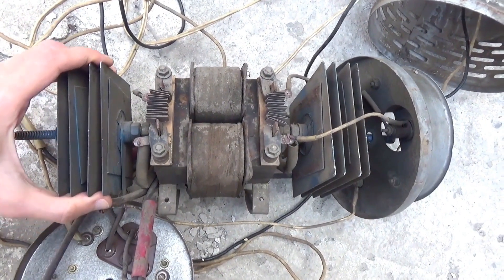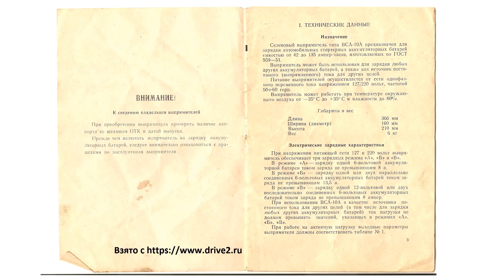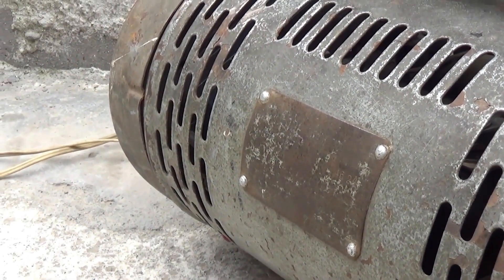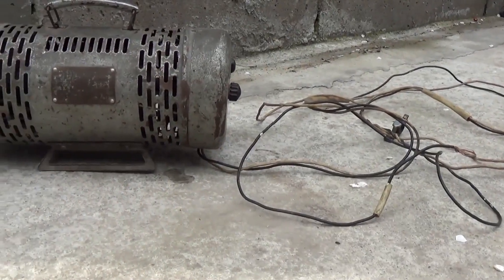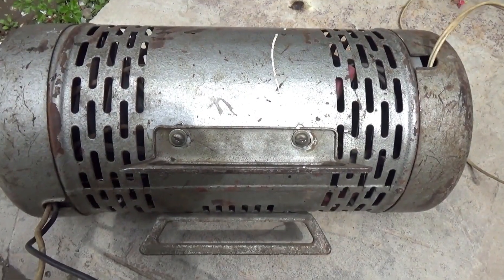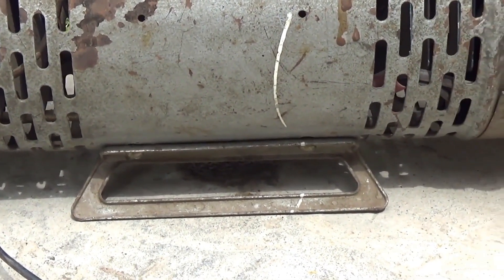The mains transformer was very much liked. Despite its age, it is almost silent. The rated power of such a transformer is about 100 watts. The maximum charging current for 12-volt batteries is 8A, which is quite good. In the case of charging 6-volt batteries, the maximum charging current also reaches 8A. The device is quite good, and its age confirms the fact that the charger is extremely reliable and can serve faithfully for more than one generation. I'm sure many of you have seen such chargers in the garage with your grandfather or father. Touching such things, you realize that this is a piece of history, created at the height of the Cold War and possessing high reliability. Moreover, the device was made entirely by hand — every screw was turned by a person. This is worthy of respect and a reason for pride. Once, we were able to create truly everlasting technology.